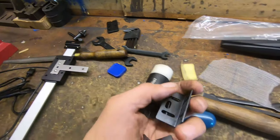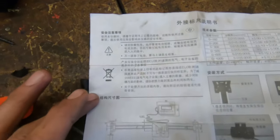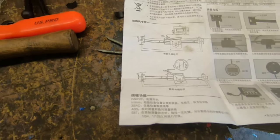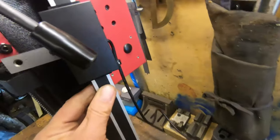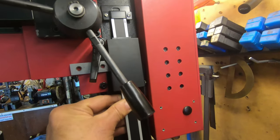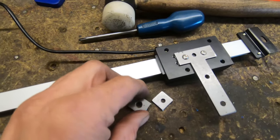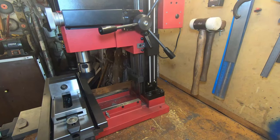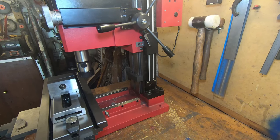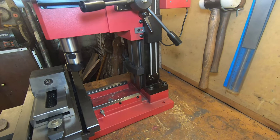They give you a bunch of brackets with the DRO, none of which were any use whatsoever. Had a quick look at the instructions, which are clear as day — obviously an old established English firm, would be my guess. So I ended up making my own bracket from a bit of scrap steel. The idea is to mount it thusly, more or less. I didn't have any wedge-headed screws unfortunately — they're 3mm screws — so I'm using the off-cuts from my bracket as stand-offs, and I hope that will give me enough clearance for the slider to go up and down. So there it is, all neatly screwed into place. It lines up really nicely, there are no undue forces acting on it, and it's very smooth indeed.